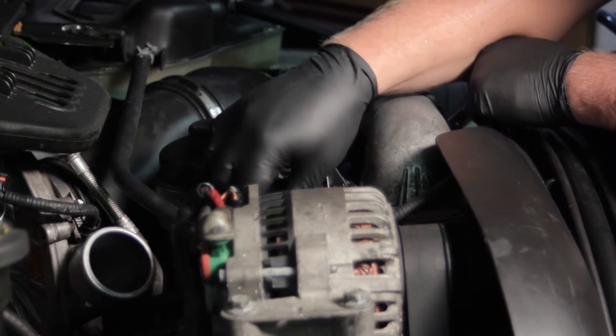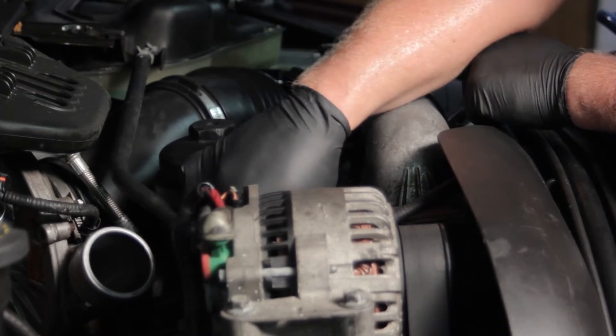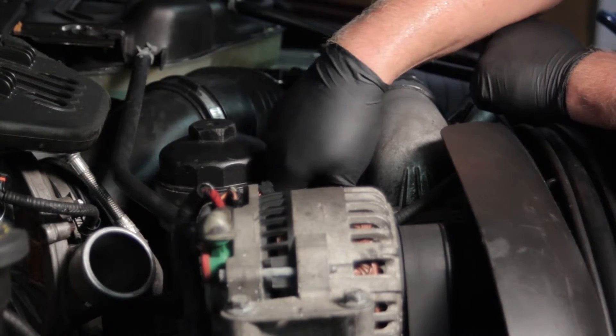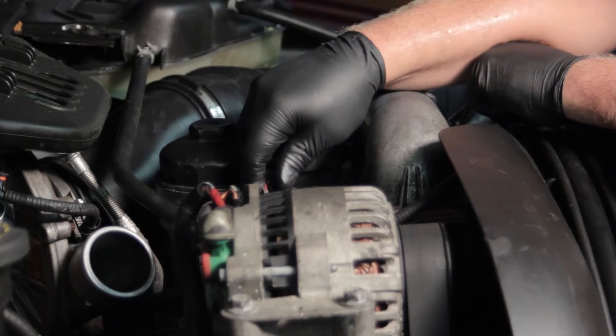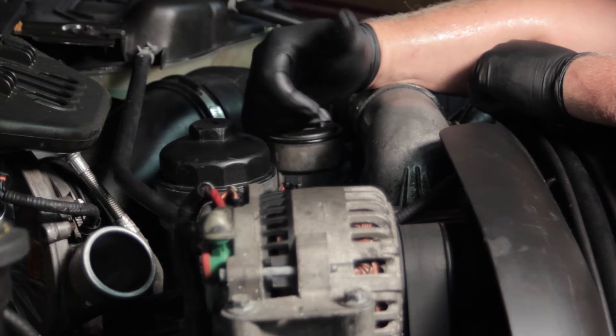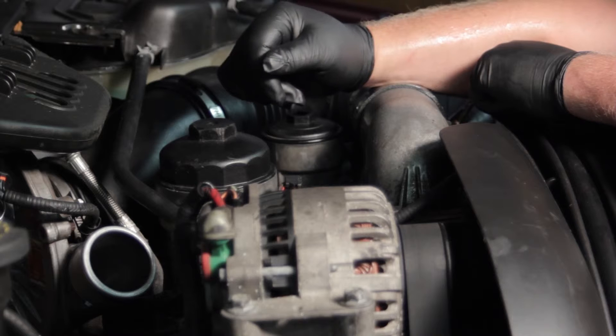I don't want to use silicone grease because that could damage these particular o-rings. Now that it's lubricated well, I'm going to slide this down into the hole. We don't want to force it in — because we've cleaned this up pretty well, we should be able to slide it in and get it sealed down in place. I'll install the two bolts, make the electrical connection again, clear any codes that may have been set, and it's all set to go.